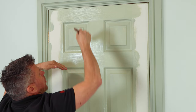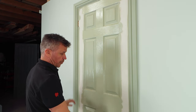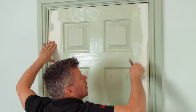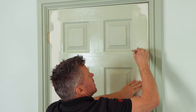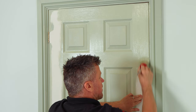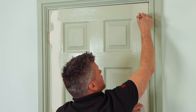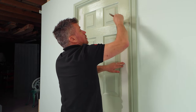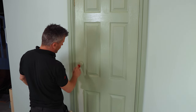Where I'm crossing the grain I went up onto this bar and then across where that grain runs, and then these two side sections come all the way down full length. If it was a solid wood door this approach would apply equally — this particular door is a lightweight one but the surface is compressed to give a wood effect. When you paint the door you still want to be able to see the grain and certainly no brush marks. The Al Fresco range dries flat, so it's great for beginners — it allows you to get a fantastic result even when you're not a professional. Millions of Frenchique customers say it's easy for beginners and the choice for professionals.